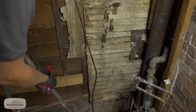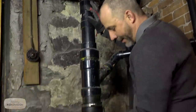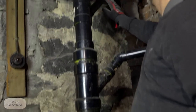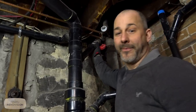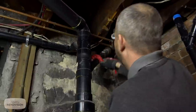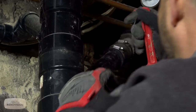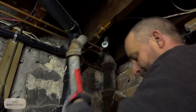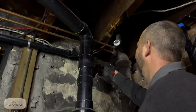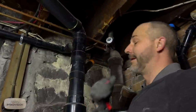They put in an ABS system at some point, chained off the old cast iron pipe, connected it to the existing steel — probably because they didn't want to open up the walls during the last renovation. Now that we've gotten rid of the steel, I'm just going to take my handy little pipe cutting tool and cut the back side as well, and get rid of the rest of this. Remember: whenever you cut and expose your pipes, take the two seconds to put on a test cap until you're going to do your plumbing — that'll keep the sewer gases from coming into the room.